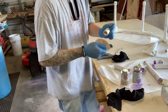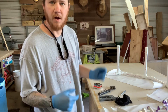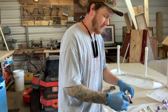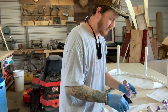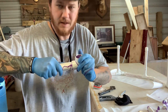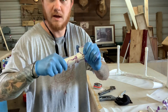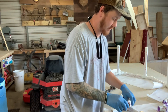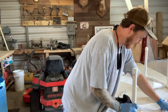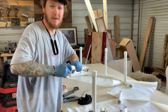I'm going to lay this back out the way it goes so hopefully we don't glue it together wrong — pretty much once it's glued, that's it. So we've got about half of it primed; we're going to go ahead and get this half glued up. When you glue it, just put your glue over where your primer is, put a little bit of glue in your fitting, and you always want to push and twist. That'll help get any air out of the joint and make it real tight. Hold there for a second.